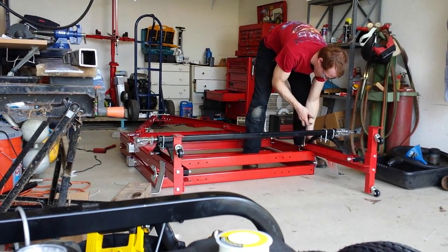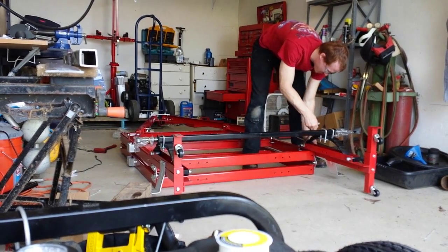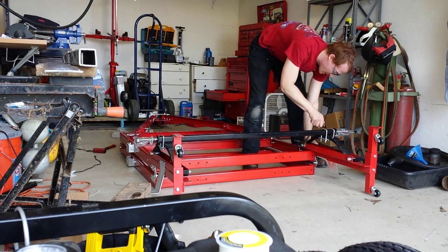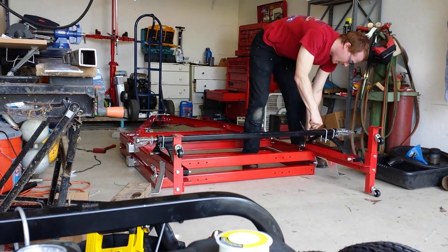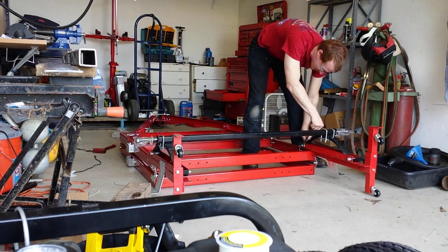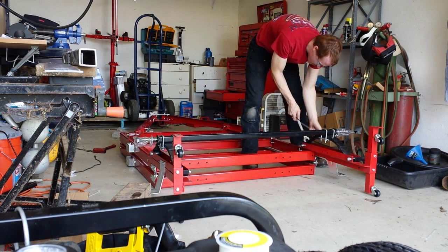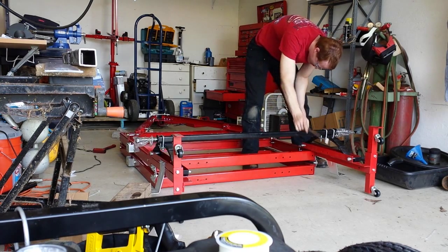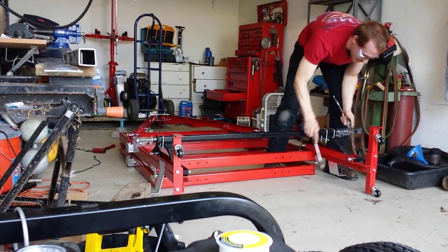I don't want to sandwich these things in here. Oh, they just have a plastic bushing inside the spring, and it's not even as wide as the spring. So if I tighten it up too much, I can collapse this U-channel down. It is collapsing a little bit as I tighten. It'll collapse right down against that spring and bind everything up.